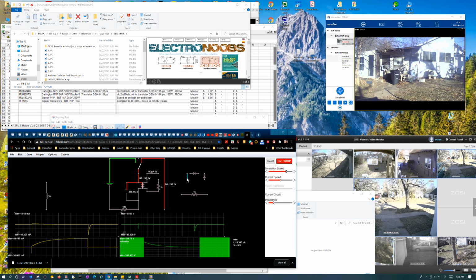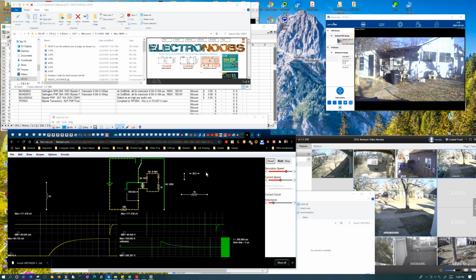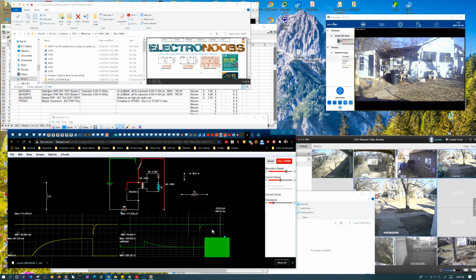But like I said, we put the diode back in there, and it'll behave pretty much the same, right? So that's about how long it takes to charge, and that's how long it takes to discharge. That's how much voltage it generated and how much current, and everything's behaving exactly like you'd expect. The diode made no real difference. I know it has the same amount of energy in it because the load is disconnected when we're charging and reconnected when we're discharging. So this enforces that diode behavior. That's why I was led to believe they do this in an SMPS.